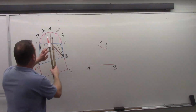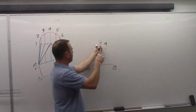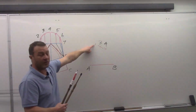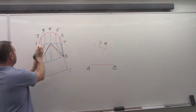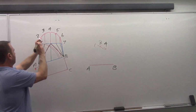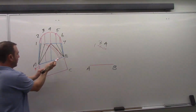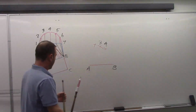While I'm here and I still have this step off set, I'm going to swing another step off, and it's kind of going out of order. But I'm preset here, so why not? Save some time. So this is now working towards point 2. So again, I'll pick up line 2, bring it down, profile 2, bring it down, and the hypotenuse becomes point 2.